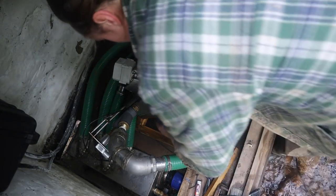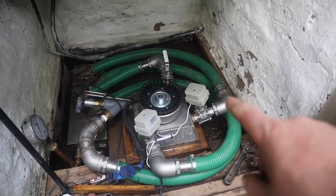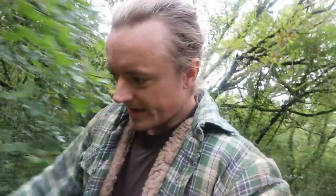Right, we're ready to drop this back down into its slot - it is one heavy awkward thing. We'll go back and try that one now that it's tuned and see how much we're getting out of it, then tune the other one and do a full power test. On our way back to the power shed I'll make a few predictions. That nozzle was way, way low - I confess I did detune it for the purposes of then tuning it on video. It was right down at the very bottom, it might have actually been increasing drag. I think probably about 80 watts now - I think we would have at least doubled it.